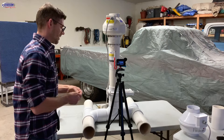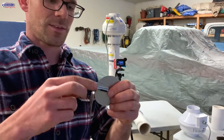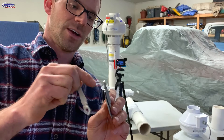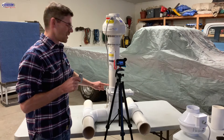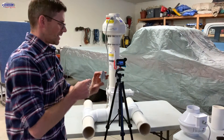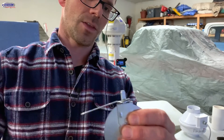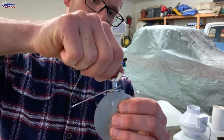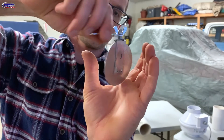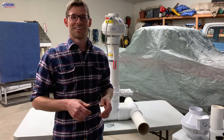So we'll shut that off and use a valve like this instead — we'll put a link to these in the description. It's got a wing nut on here — take that wing nut off — and then it's got a handle and a washer; leave the washer on. You drill a 5/16 inch hole inside the pipe — double check that size — then push this down, slide it in the hole, release it, and put a dab of silicone on there so that it gets a seal, then put the handle back on and the wing nut. Your pipe would look something like this. It does not seal all the way, but it's close enough in most cases, and then you've got some adjustment there. Remember to mark the setting and tighten it down so nobody hits it on accident and moves it.